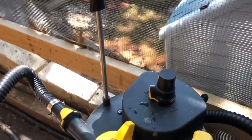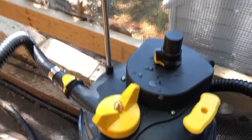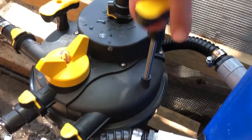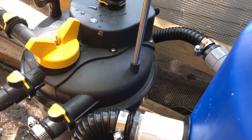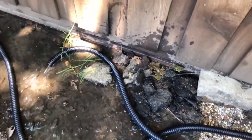One important note: the pressure filter I went with has these little scrubbers on the side that brush against the internal foam filters and dislodge any debris — in this case duck poo — to be discharged. So you don't have to open everything up so frequently. That was a big part of the reason why I chose this particular filter.